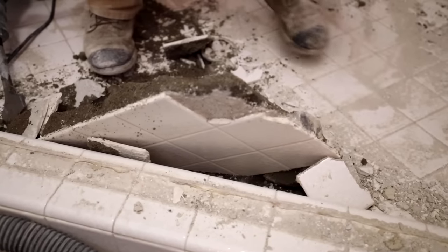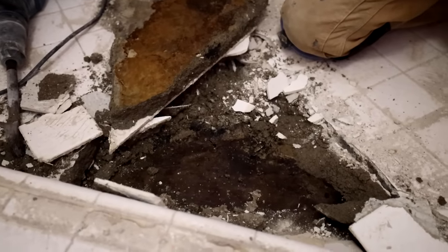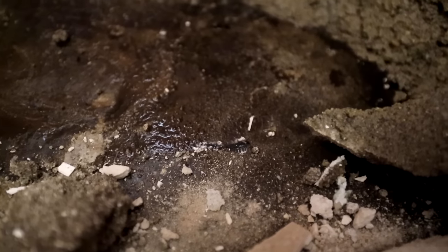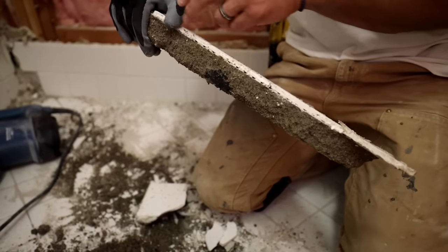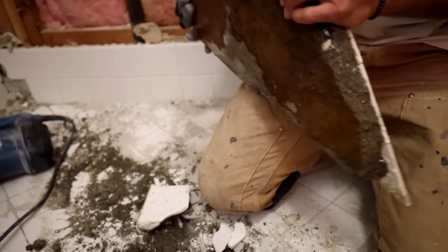Now we've got a chunk coming up. You can see here how much water is still in these mud beds - we have literally standing water in here even though there's a pre-slope. So even though in this instance the hot mop hasn't failed and it's still waterproof, that water finds a way to escape out of the pan. That's why I like using the newer sealed systems - almost every one of my videos has a sealed system where the waterproofing is right under the tile, not underneath the mortar, so the mortar would stay dry.